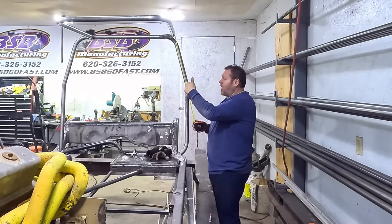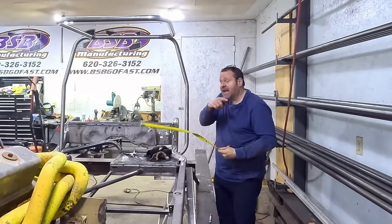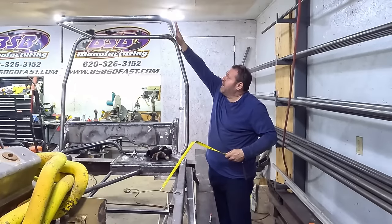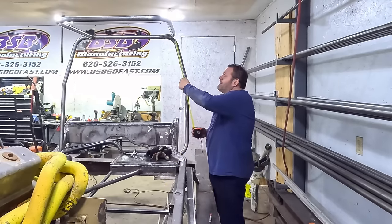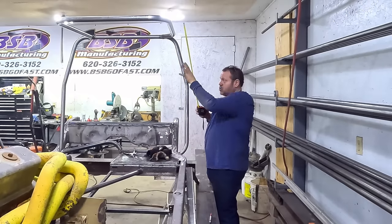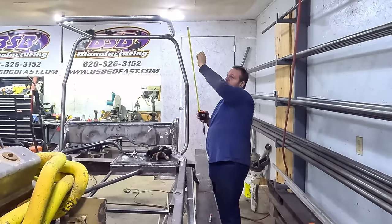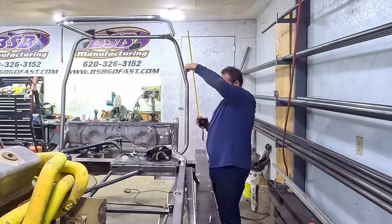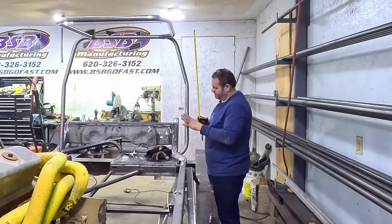I'm going to set 18 inches of opening. I've got a mark here — I'm going to put my tube below that mark so I've got 18 inches of opening right here. The reason I've offset that halo to this top — you can see where that bend is and how this tube is in alignment with that 15-degree down leg right there. That's because I'm going to put a down tube right here, so I'm going to double this and put some joiners in between them, making a real strong column right here because my head's right here. We want a real strong column for something coming in this way or an impact on top. Those tubes are going to be in alignment, it's going to look good, it's going to be stout. There's a lot more tubes and bridging going in here — it's going to be beefy.